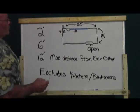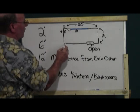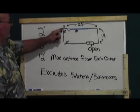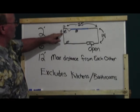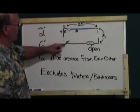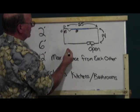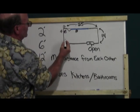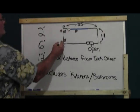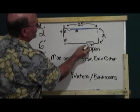Say you have a 14-foot wall. That means you have 10 feet between this outlet and the edge of this wall. You can put an outlet there because this is a solid wall — your one outlet covers the entire wall, and the next outlet is within 12 feet. Personally, I wouldn't do it that way. I would mirror it — put another outlet here at four feet, which would leave about six feet in between, and then come down here. You've got to have an outlet within six feet of this measurement.